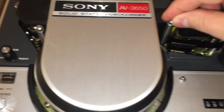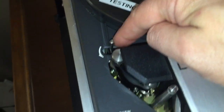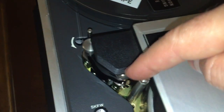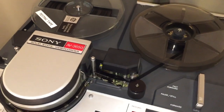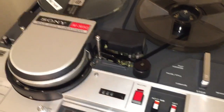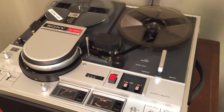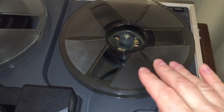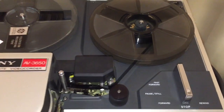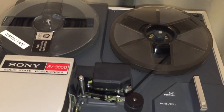You've got guide posts here and here. To thread the machine, you go to the left of this guide — this corresponds with the skew control — and just wind your tape around here, around the big video head drum, around here, and then up to your take-up spool. Now I did have to do some work to the inside of this unit. It essentially needs a new belt — I don't know where to get one yet, haven't found a source. But beyond that it works fantastic, with one exception: when I got it, this reel didn't turn at all — there was no motion. So I'm going to spend a few minutes taking the hood off to show you how I overcame the problem of no take-up or fast forward.